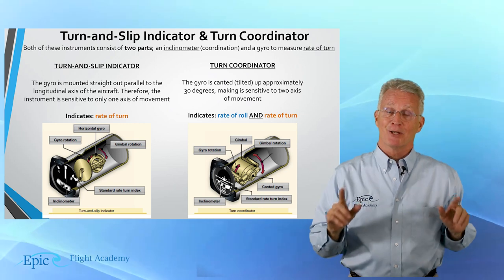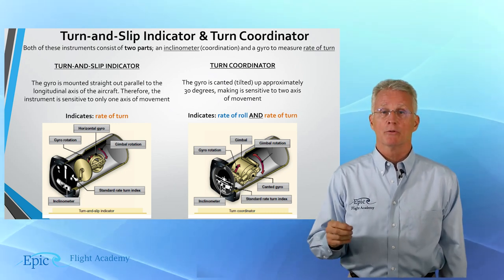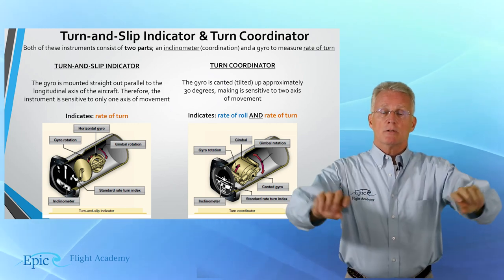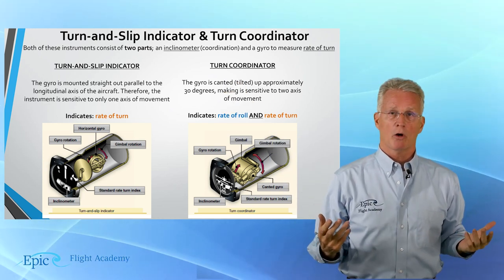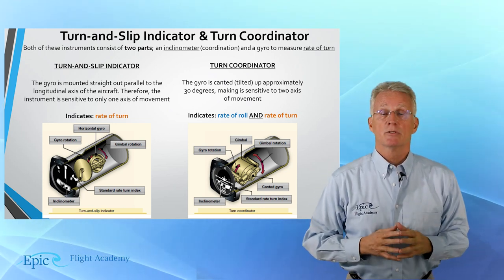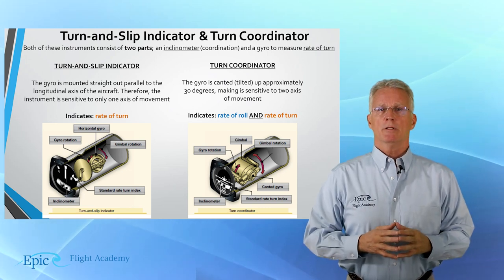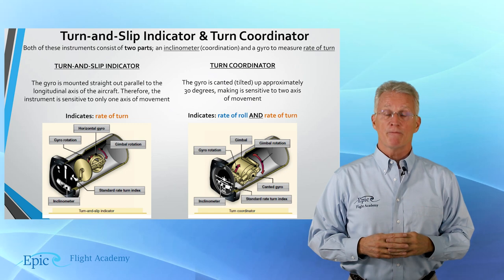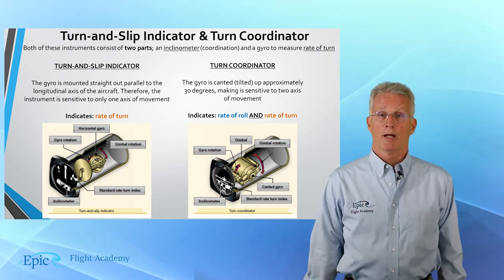If you tune in for our next video, you're going to see how I explain that operation in detail. Also, on the turn and slip indicator and the turn coordinator, you're going to find a completely separate instrument — it's this little glass bar with the black ball in it. It's mounted inside the face of this instrument, but it's actually independent, and it is called the inclinometer. Oftentimes we just call it the ball, but technically it is the inclinometer. That ball is in a glass tube filled with a dampening fluid like kerosene — it dampens the movement of that ball. We think of that ball moving in slips and skids, but what the ball is actually responding to is a difference between roll and yaw rates. The ball will move one way or another in that inclinometer to help the pilot maintain coordination.